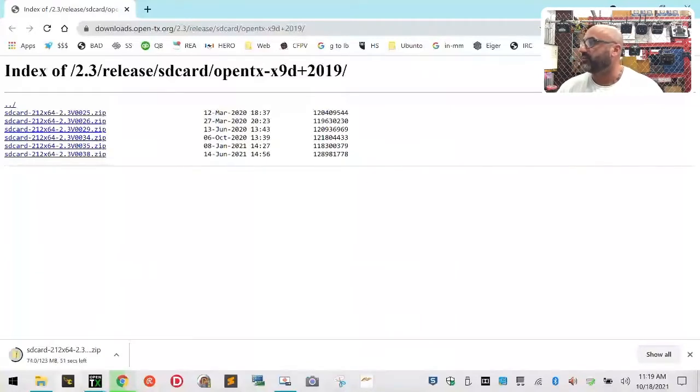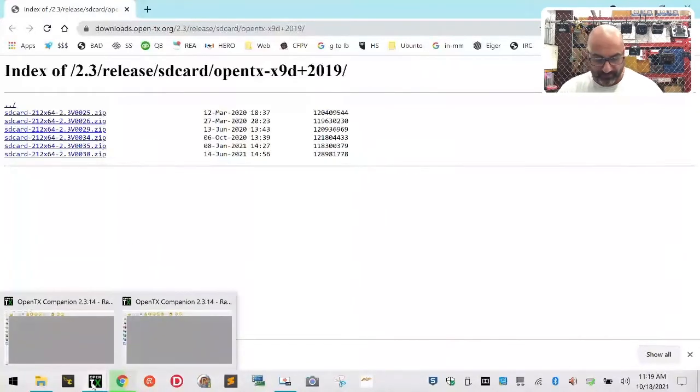So we're going to update the radio and also copy the SD card contents over, then we'll be able to do all the binding. I assume the customer added an external module on the back because he's trying to run D8, but D16 is part of this - you've got to do your updates. He's also running this Flywoo - I need to check if it's D8 or D16.